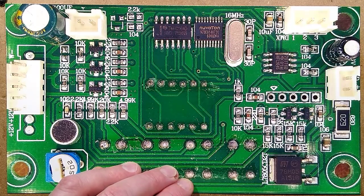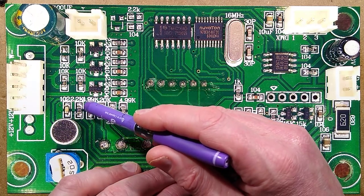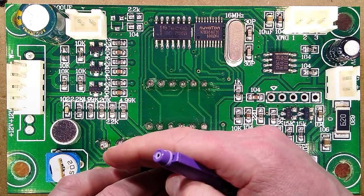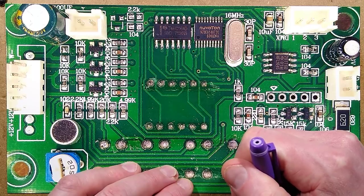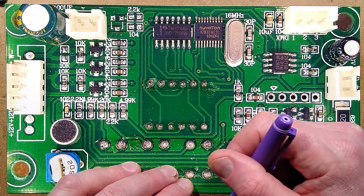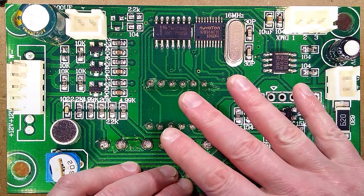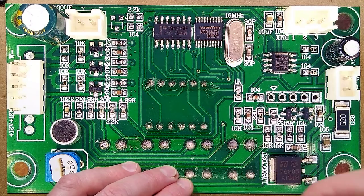And that means that the red has to be pulse width modulated. The current is being smashed through the reds, but it's being pulse width modulated so that at full setting, it keeps it within its 1 watt rating. It's a terrible way to drive LEDs. I did scope that. It was running at roughly 25% duty cycle, even when I set this up to maximum intensity in the red.